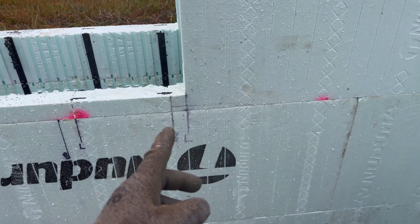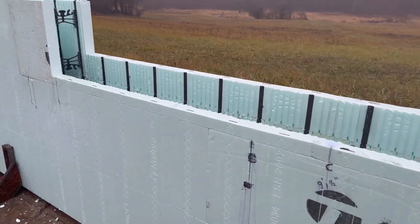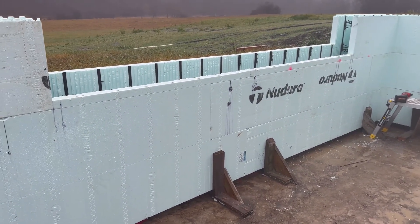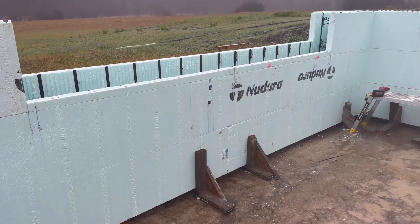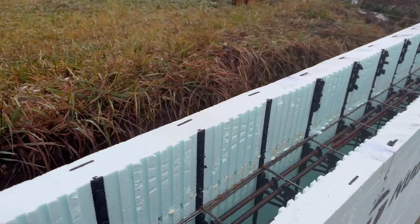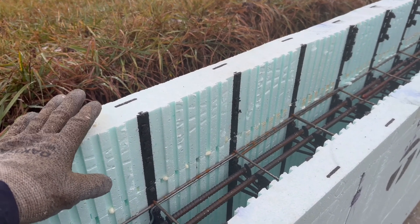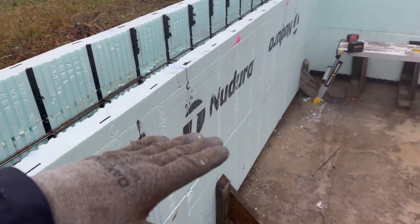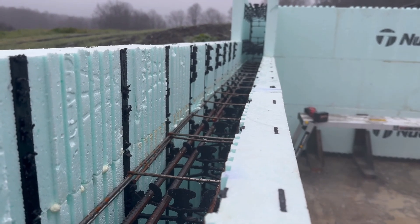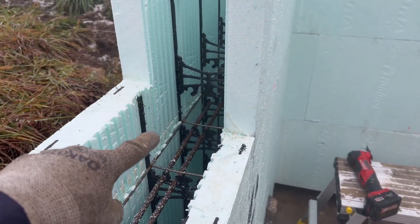The window buck will be the inside of it, and then 'L' is for lintel — so the lintel is the actual clear span between the concrete of this patio door. When you're doing all your lintel math, or if the engineer is doing that for your stirrups and your rebar above, that's the dimension that's important — the lintel. Then you might be wondering why it's stepped here. Top of my basement floor is right here, which is where the patio door is going to sit. So I didn't want concrete going to the outside. This is a thermal break of two and five-eighths on the outside. The concrete floor will be in here like this, and it's stepped down four inches from this point to this point, which obviously represents the thickness of the basement floor.